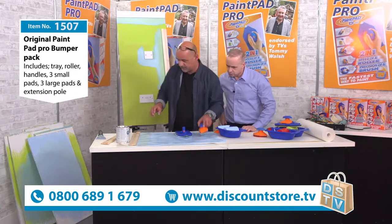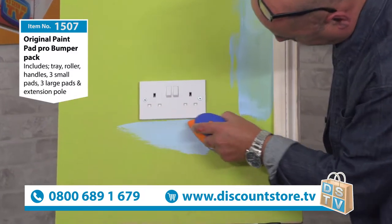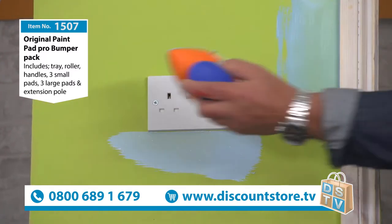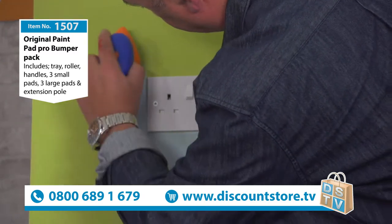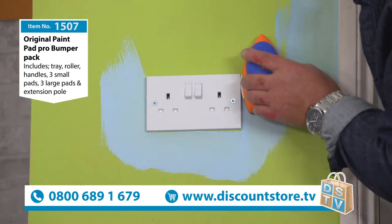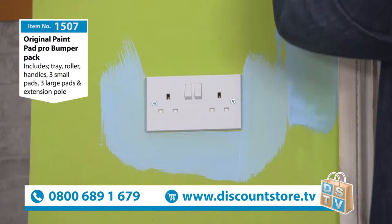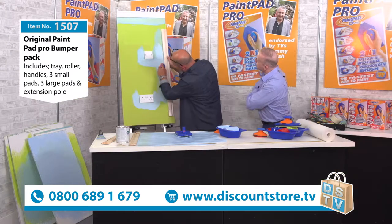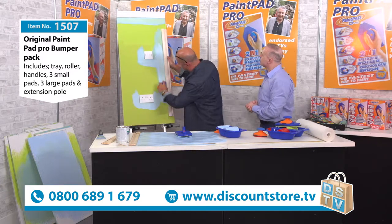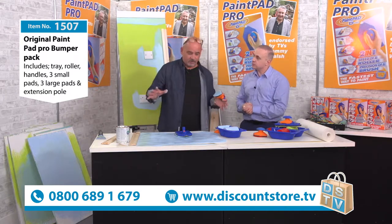Let me show you very quickly - on the jobs that everyone hates - around the plugs, around the switches. Just wipe along the edge like so; you don't have to remove the switches or take light fittings off, you just go around them. You cut right in - something that if you're not used to doing, or you're not confident with electricals, it is a daunting task. And as you can see there's a second coat going on, right into the edge around the doors. Forget about taping and masking - when you pull the tape off it takes the paint with it.